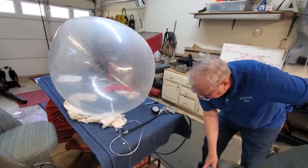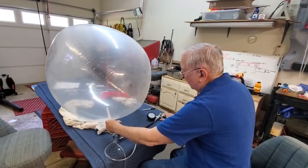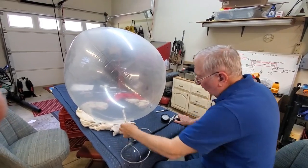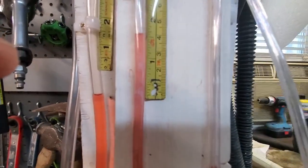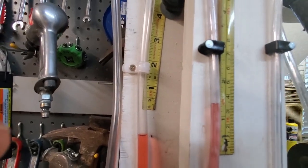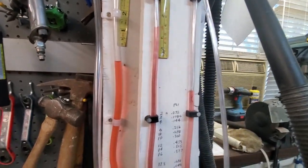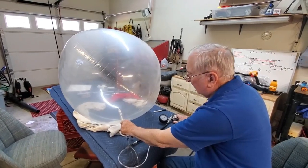We are starting to get pressure here now. Let's put a little bit more in and see if we can measure this. I'm guessing we're down around 0.3, so we're going to turn this off and turn this one on. That's showing about — how many inches there? About one and a half. So we're at three inches of water. We've got about three inches of water column — that's not very much pressure.